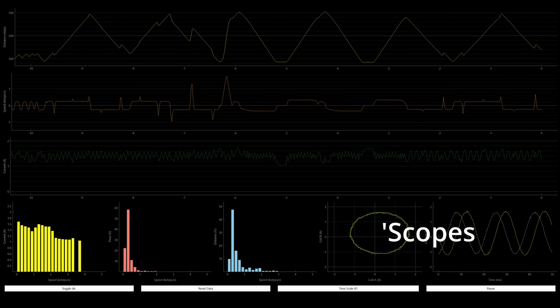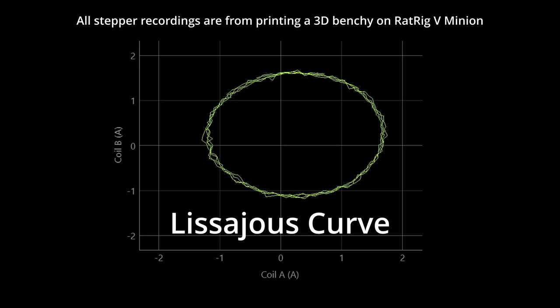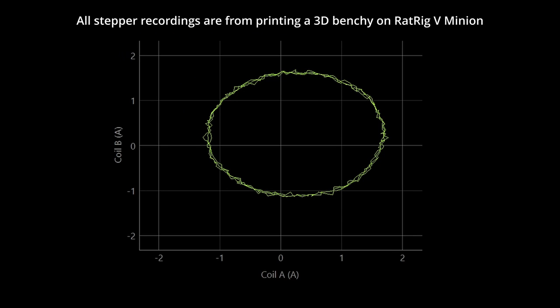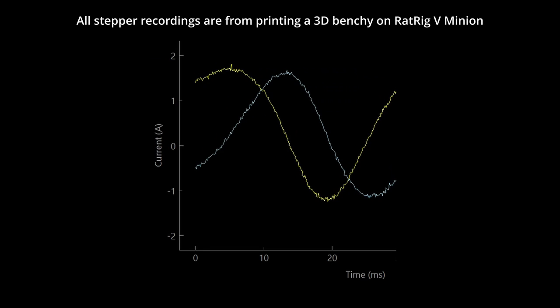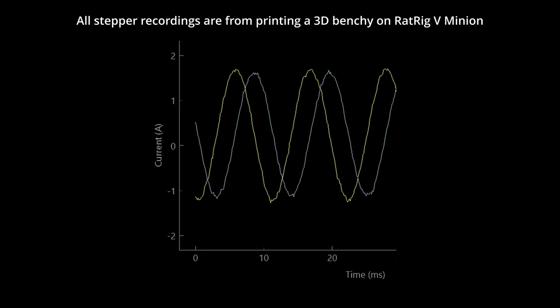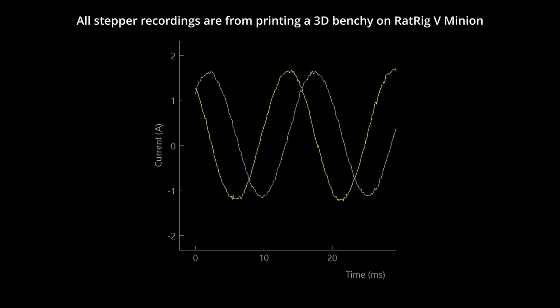Along the bottom right corner, we have two oscilloscope readings. Firstly, we have a phase graph, also known as a Lissajous curve, which shows the cleanliness of the current signals to the motor. If the shape decreases in size, this means that the current is lower. If the shape is kind of deformed — not a circle, maybe spiky and weird — it probably indicates that there's insufficient current delivery to the motor. If the shape is square, this indicates that you're in full steps mode and no microsteps; more microsteps will smooth out the curve. The other graph is an oscilloscope graph. These two current samples, shown out of phase, should look like perfect sine or cosine waves, but deviation from that or rough curves can indicate issues, such as low current at high speed.